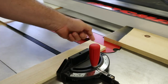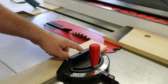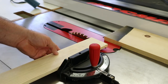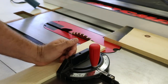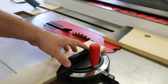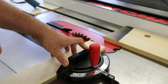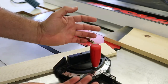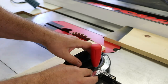As this thing's cutting, it's putting force on the board and trying to drag it into the blade farther. If the blade pulls the board into the blade, you get that same violent kickback — it's easier to push the board than to cut it. You can prevent that by keeping it rigid up against the fence of the miter gauge. And remember, you can always rig up clamp setups too. If you don't think you can hold something tight enough, or when cutting at a miter angle it can be harder to hold, you can rig up things that hold it rigidly in place — we'll talk about those in a later video.